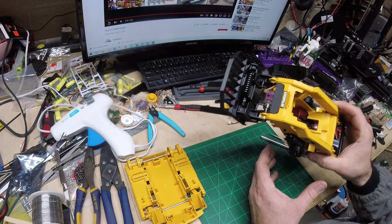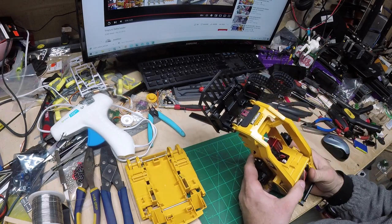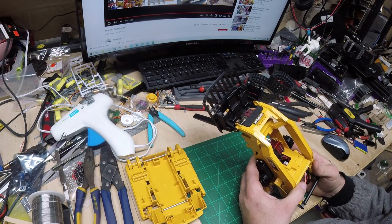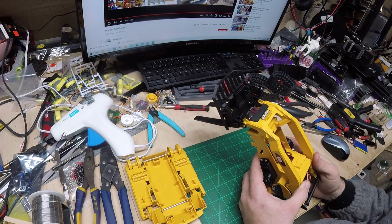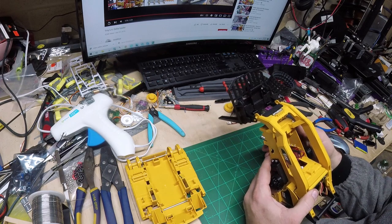It's kind of pretty quick to wrap it all up, and then we'll do some playing with it. I did some playing with the servos. I'd mentioned in the last video that the micro servo is rated for 4.8 volts. Like I said, this is a 2S LiPo at 7.4 volts. The receiver takes 6 volts, and I've been doing some playing. I'm having pretty good luck with just running it, so that's what I'm gonna do.